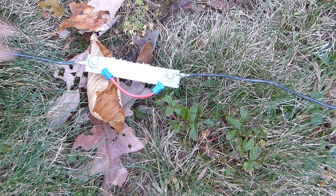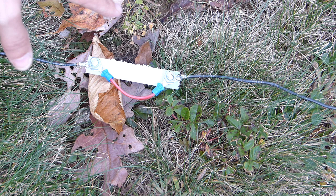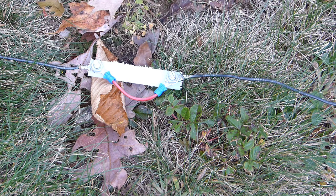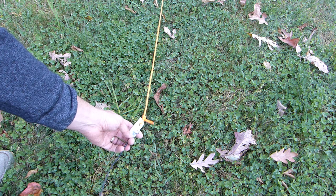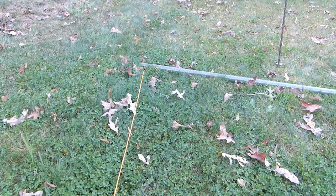Here's a look at one of the links. Right now it's connected so the antenna will work in the 40 meter configuration. If I want to run 20 meters I just disconnect this link and let it hang, and then this shorter element becomes the 20 meter element — though the link wire is still here to structurally hold things together. At the end of the 40 meter leg there's a short insulator also made from scrap cutting board, and it's tied off to orange paracord which ties to a hole drilled in the top of the end pole.